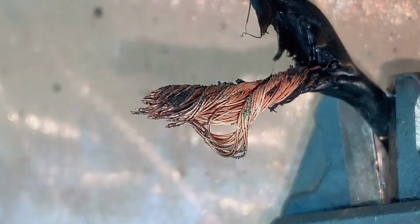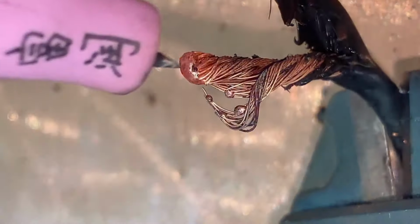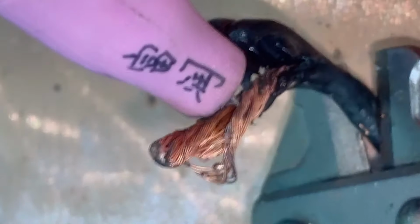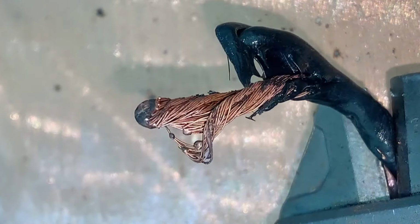The first point is the difference in welding temperature. The temperature of the welding pool is 2/3 lower than that of the TIG welding machine. The welding time of the cold welding machine is precisely controlled, and the temperature of the base metal after high current welding is only tens of degrees, which can be touched by hand.